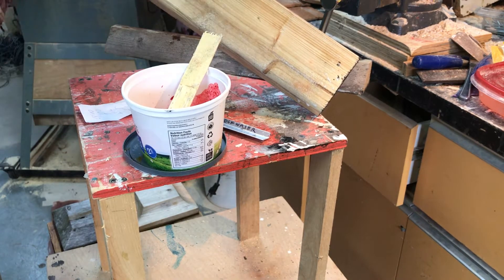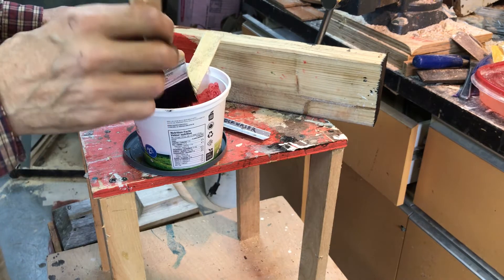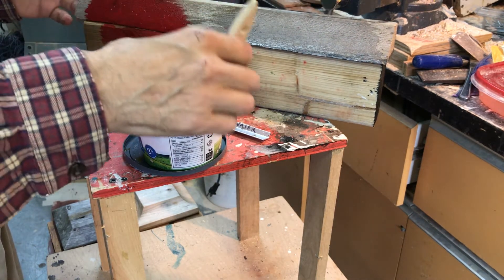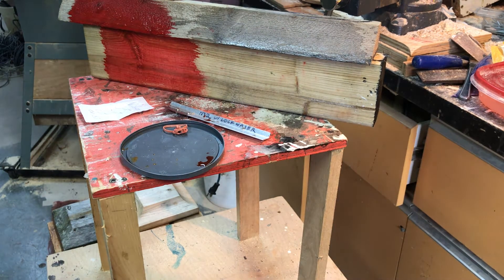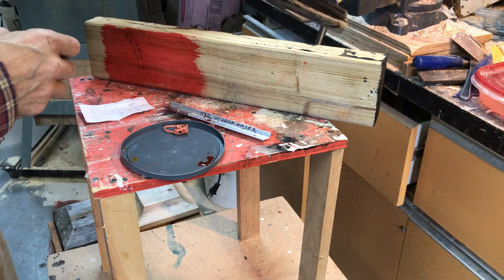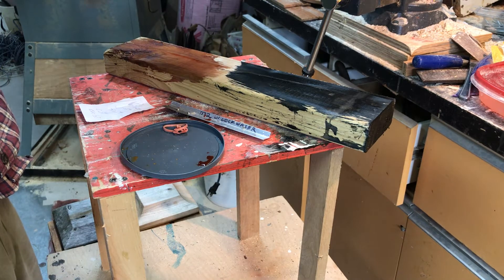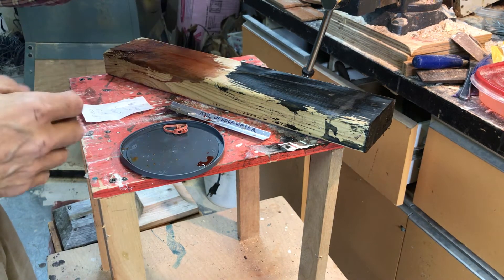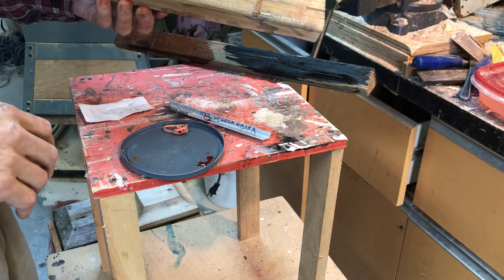This is the brown pressure treated wood. I went back and forth by email with this company about the stains. When I got these products it came with a flyer that said at the bottom of the instructions 'not for use on decks' — wait a minute! They worded that very poorly. It's fine to use on the deck as a walking surface, but after some years where you're walking you'll want to recoat because the dye will wear down. So there's no problem with decks — they really should change that on their flyer. The black is very dark and nice, the brown I particularly like, and the red also.